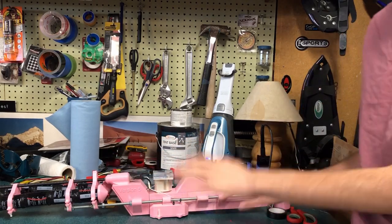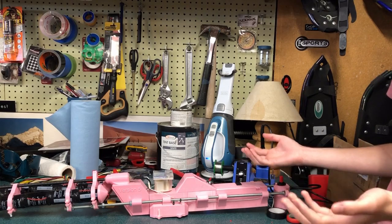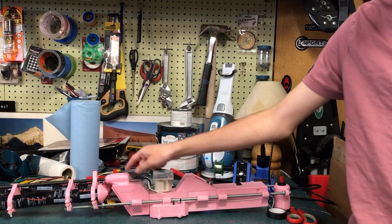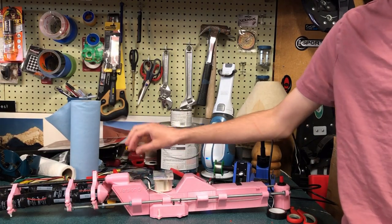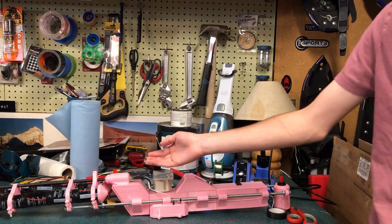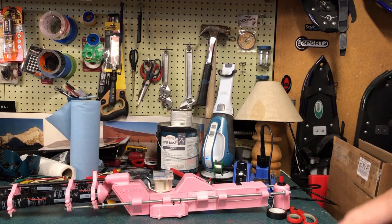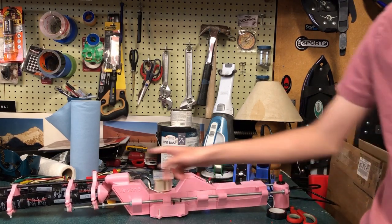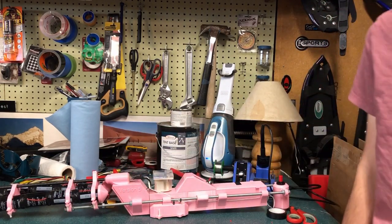The proper name for what this device is is an electrothermal accelerator, which sounds like a lot but is pretty simple. It uses an electrical arc to heat up the gas in the blast chamber — this little area. A lot of hot expanding gas and plasma in this chamber just pushes the projectile out of the barrel. I use a barbecue igniter to create a spark, and then the capacitor bank discharges through the spark and creates the hot gas and plasma.